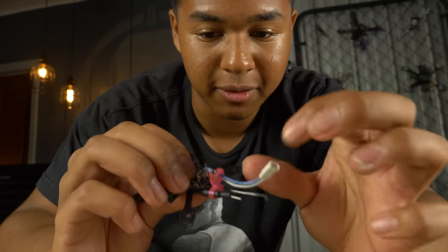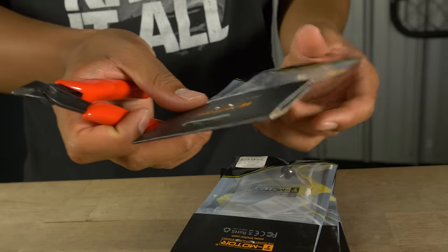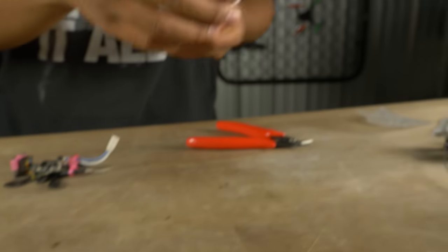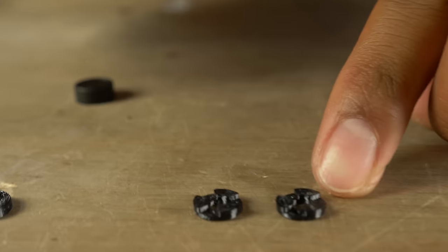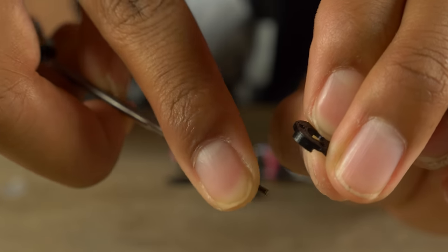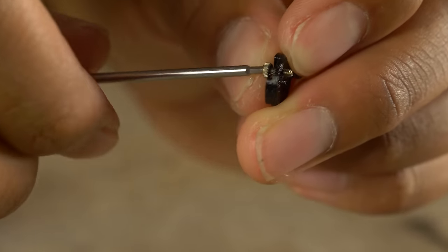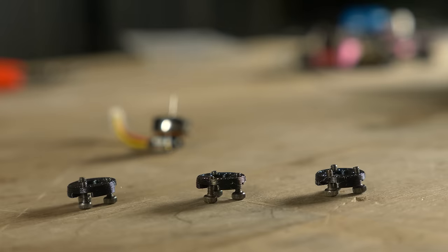Make sure you don't connect the battery the wrong way — that's the easiest way to mess up this build. Now grab the motors: T-motor 0802 25,000 kV, super light and super speedy. Keep the screws that come with the motors because we use those to mount to the frame. Grab the 1.27mm driver. In your assorted 3D prints you have little skids — use these as spacers when mounting the motors. One side is flat, one has divots; the divots go on the bottom with the screw heads going through. Thread all screws into the 3D printed skids — three screws per skid to match the three-hole motor mount.